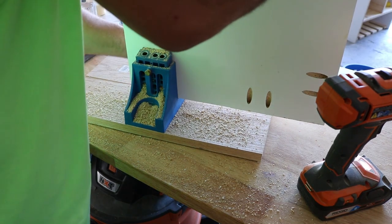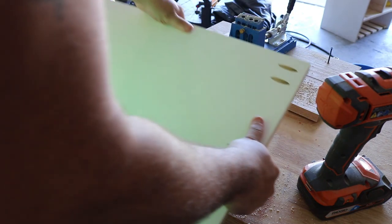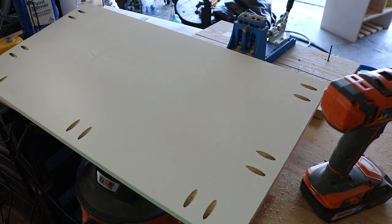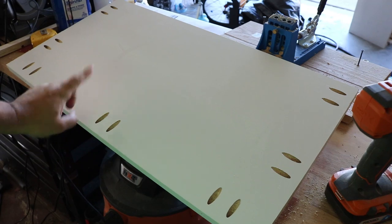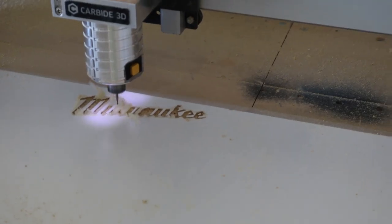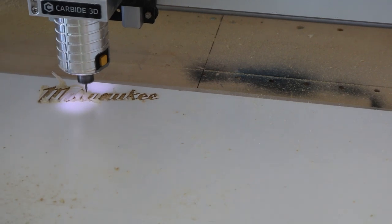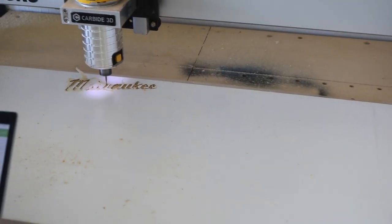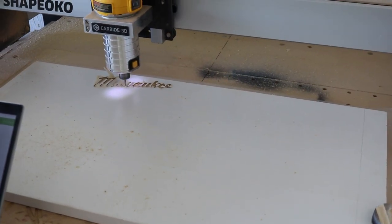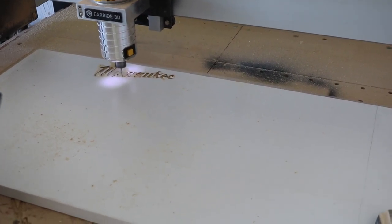We cut one more at 30 inches. We're using a Kreg jig today — if you do this type of work a lot, you really should have one. We're not sponsored by them, but they do a great job hiding pocket holes and they're really secure. We put two pocket holes on the side, three on the bottom, and two on the other side. Then I added my logo on the front — the Milwaukee 'Nothing But Heavy Duty.' Not everybody has a CNC, so you can use a decal, sticker, or even draw it on with carbon paper and paint.